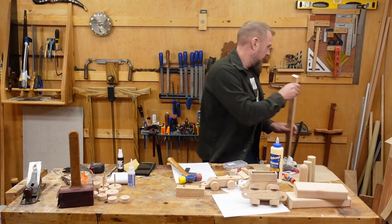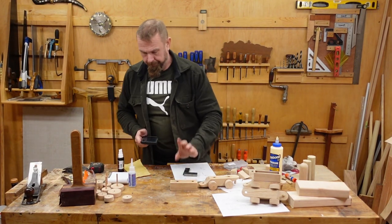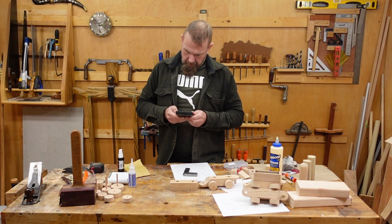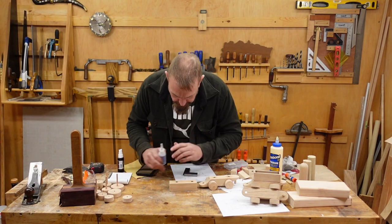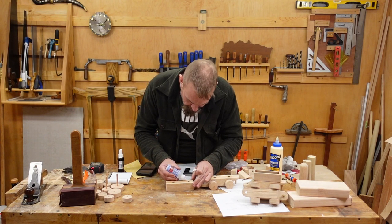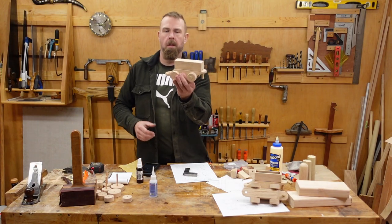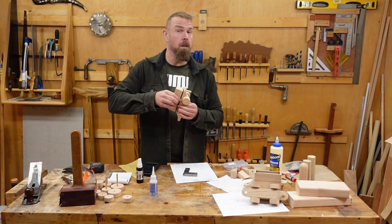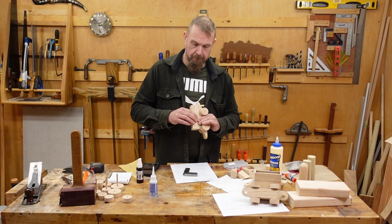Slide that away now and finish driving it in. Those aren't going anywhere. If any gap is visible after the glue is dried, you can carefully place another drop of thin CA glue where the magnet meets the wood — this glue will wick into the hole and ensure adhesion. Even with it being that tight, I can see a little bit of wicking action. That is almost pinchy — like on a child. Time to ask my wife about that. May need to specify weak magnets.